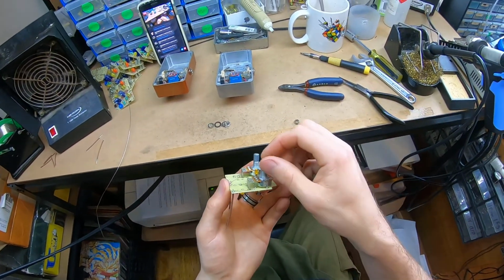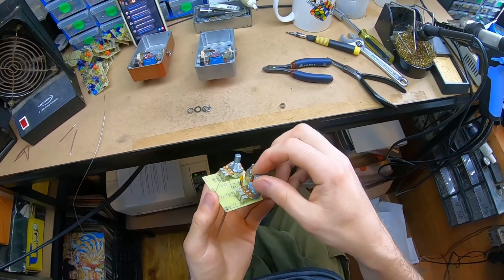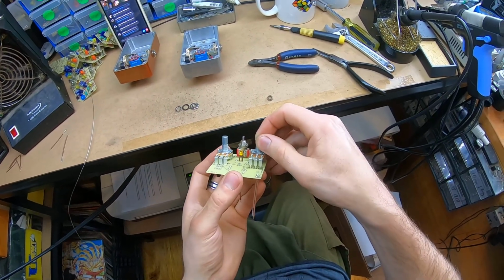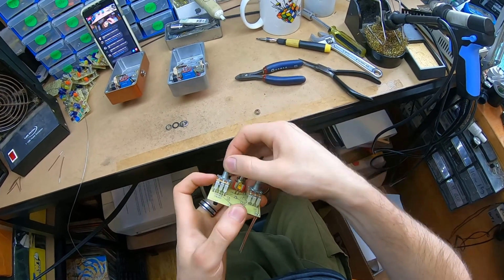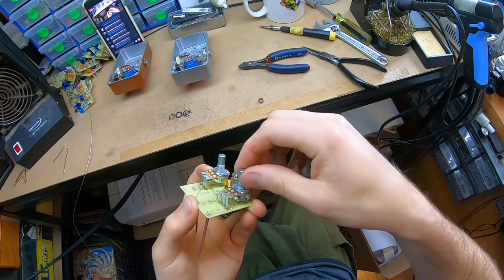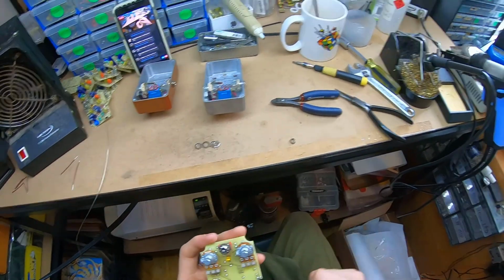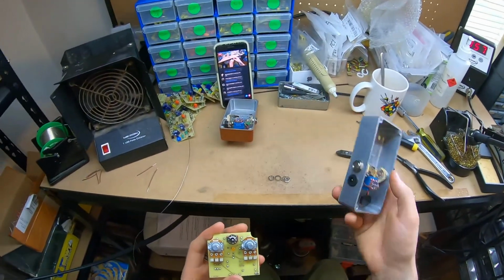Now normally I chuck little insulation pot covers, or pot condoms, you might call them, but I won't with this one because I know where the toggle switch is going to bring these up, if you can see that, I don't know where the camera is. So that's plenty of space to not have anything short out underneath. No need to chuck extra plastic into a product, I think.